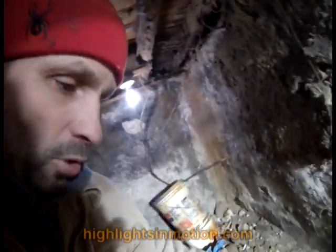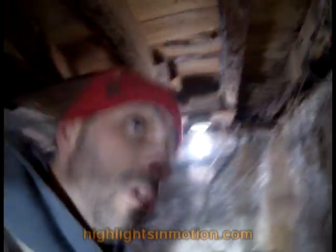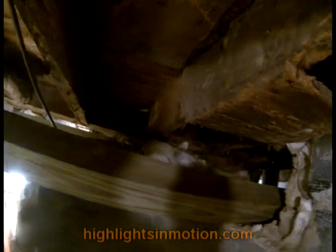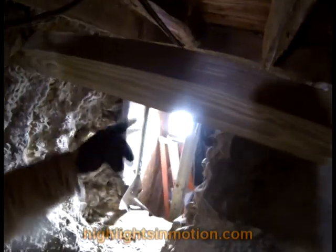This is concrete, but it's probably only like maybe 2 inches thick. So I'm gonna pour another 12 inches on top of that to create a better footing. Because this beam right here I got, that's where I cut that hole, bust that hole open. This is going up against here. Gonna put a jack post right here to support the floor joists on this side. Because that beam over there, it just don't do nothing. It's just crazy.